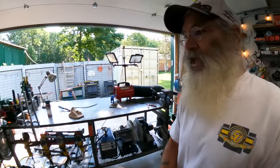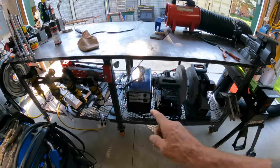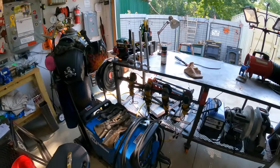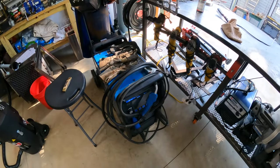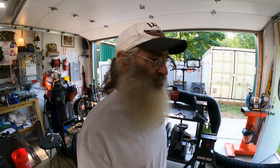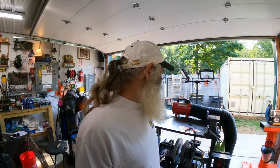But it's shielded gas. And I very seldom use flux core wire unless I'm using my 110 for smaller projects. Flux core, like stick welding, creates a lot of smoke, a lot of toxic environment. And shielding gas, not as much. That's kind of why I use it more than anything. Because they say flux core wire MIG welding actually gets better penetration than shielding gas, but it's neither here nor there.